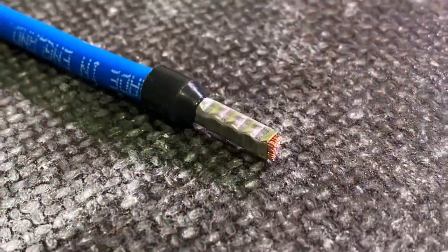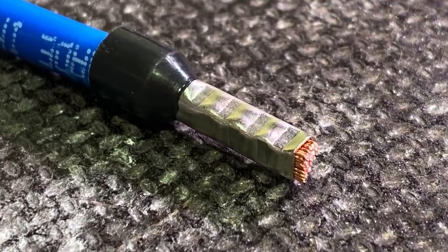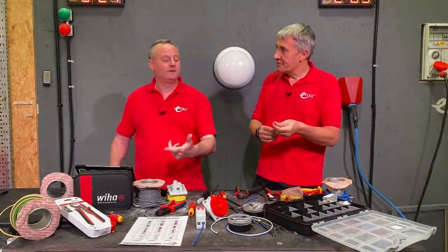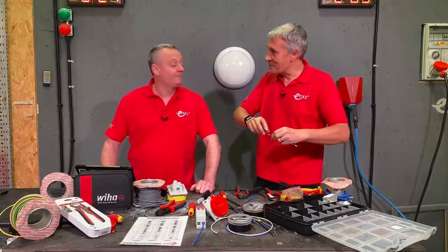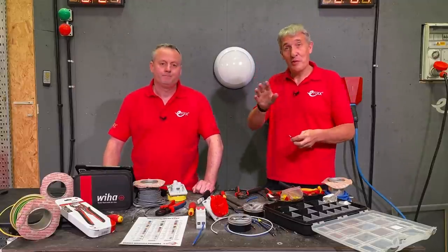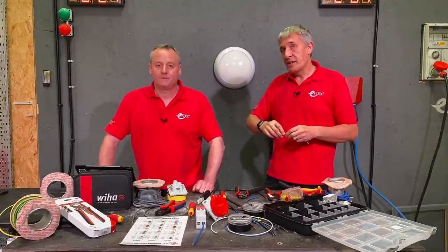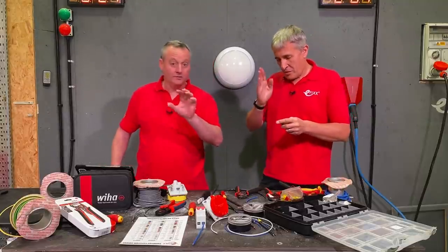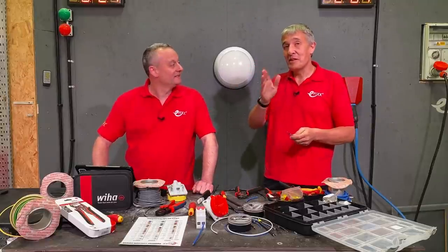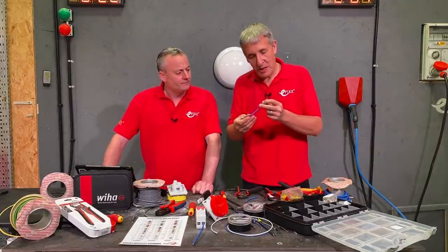There's a debate about having a tiny bit of copper sticking out the end. When we looked into it, you should leave a tiny bit of copper out, and the advice is a gentle twist — though some say never twist, and others over-twist. Don't twist, because you start increasing the diameter of the conductor. The suggestion from a manufacturer's white paper — which we'll link in the description — is a light twist to restore the original twist of the conductor, with 0.1 to 1mm overhanging depending on conductor size.